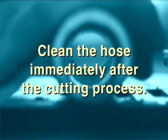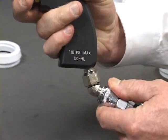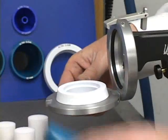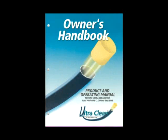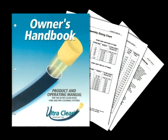It is vitally important to clean the hose immediately after the cutting process. Connect your ultra-clean launcher and full-flow quick disconnect to a filtered and regulated air source. Load the recommended nozzle and ultra-clean projectile into the launcher's faceplate. Nozzle and projectile sizing charts for hose, hose assemblies, tubing, and pipe are supplied with each unit along with recommended cleaning procedures.